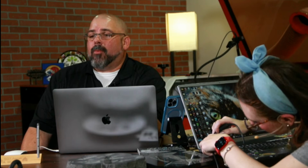Now, a lot of you will hear of machines, they'll say, oh, we can run our machine at 1,000 DPI, or 15,000 DPI, or 500 DPI. All of that is true to an extent with most lasers, CNC lasers and the AP laser. But what is important to know is while you may be able to use the motion at that high of a DPI, the effects of the laser and how the energy is absorbed into the material is the driving factor on what DPI we should use. Not what we can use, but what we should use.